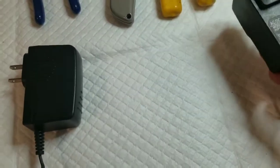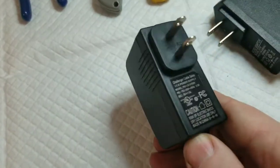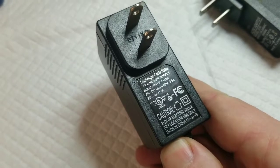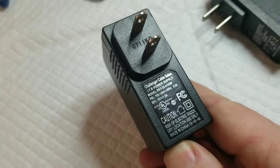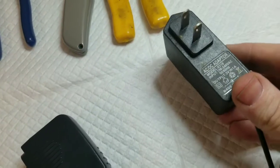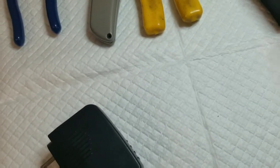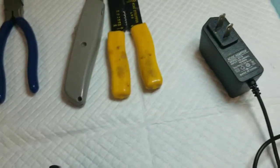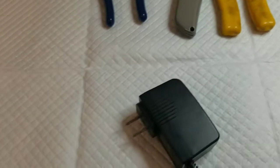So now we have one that's very low, and let's see what this one is — this is our Goldilocks zone. It says 5 volts DC with 1.5 amps output, and that's the one we're going to use. Lower voltages work better to get a better plate. I know it seems weird that a higher voltage wouldn't do that, but it's the lower voltages that you want to use.